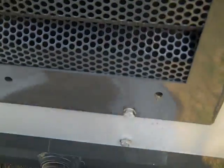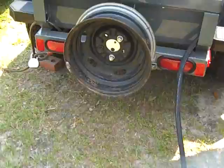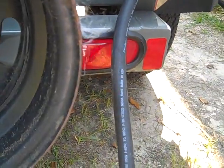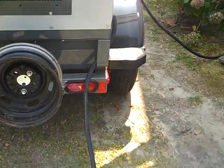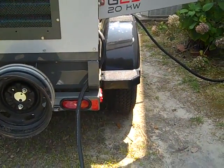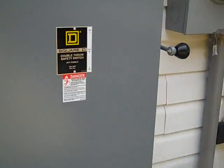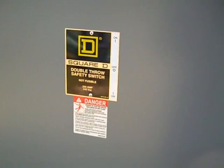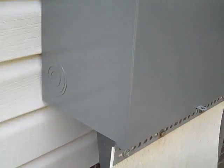He added an old wheel mounted on the back of the trailer to wind up the heavy-duty cord — keeps it out of the sun and dirt. Hooking a generator to a home legally requires a transfer switch. Here's a Square D double-throw transfer switch — these are expensive, around $800. There's also a mud flap protecting the connections from UV light. With a portable generator, the challenge is always: how do I hook it up legally?